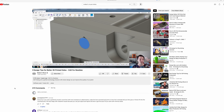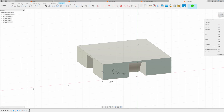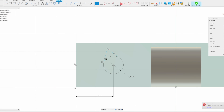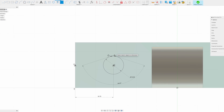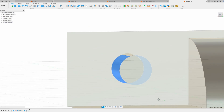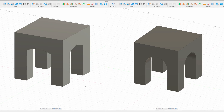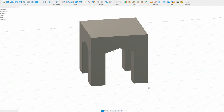What if instead of a circular hole, we design a teardrop shape? This design concept comes from everyone's favourite Aussie 3D printer, Maker's Muse, where instead of keeping the hole circular, you make the very top an angled roof. Go into your sketches and make a circle. Then draw two lines above it, set them to be equal and tangent to the circle, and set the angle between the two lines to be twice your overhang angle from the overhang print. Extrude this profile and the inner surface is still a majority circle, except for the top section, which completely eliminates the need for support material on this feature. Not only does this design work for holes, but it also works for arches. If you're making a project that has a doorway shape, the top will just droop down — but by switching your design to a pointed archway, you've now got a successful print.